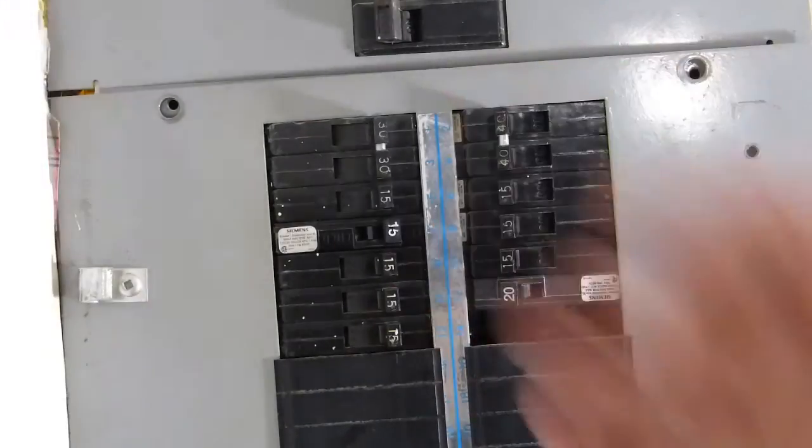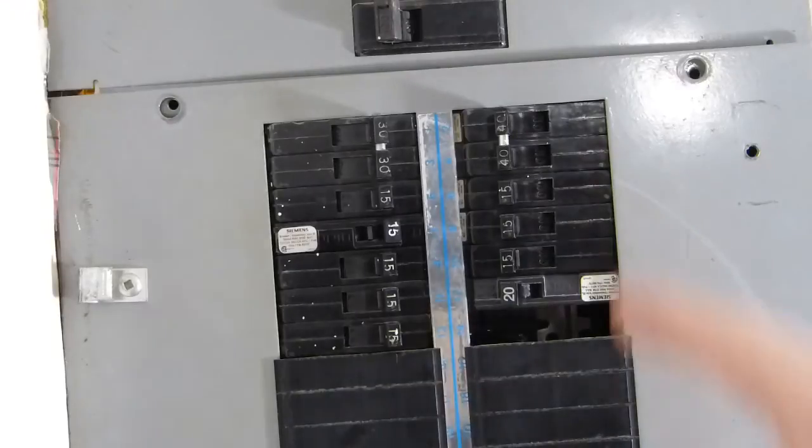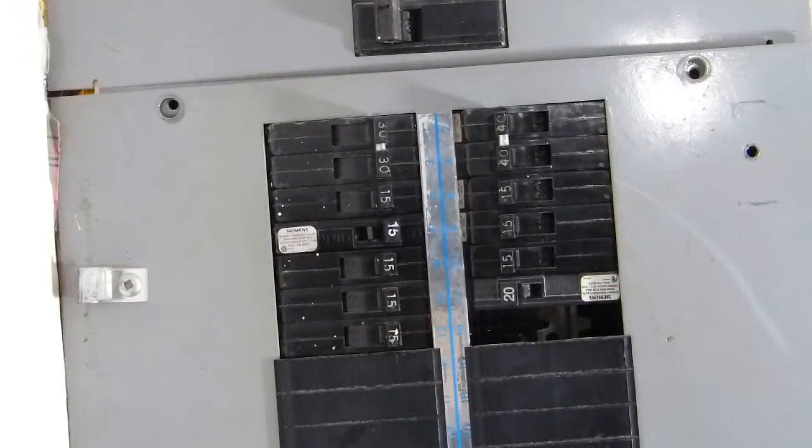It doesn't matter how old this is — it only has about 10 circuits or so. It's from 1971, fairly old, but it works safely with the wires that were installed and manufactured in 1971 or so. So that's the original circuit breaker, but if there are additions, changes, renovations, or alterations to it, it's important that those be done safely. Usually that's not the case — usually how additions and renovations are done is patch on patch on patch, and circuits get overloaded.